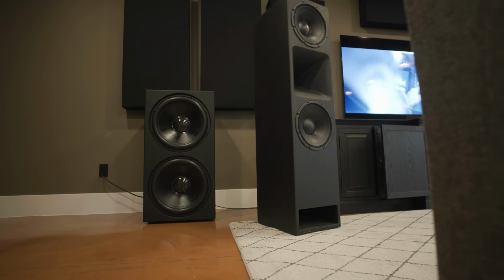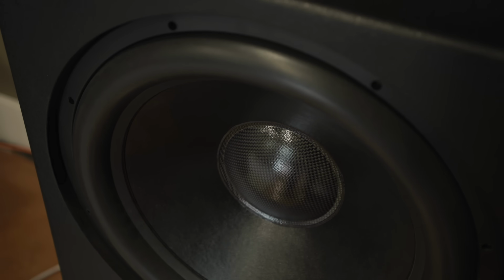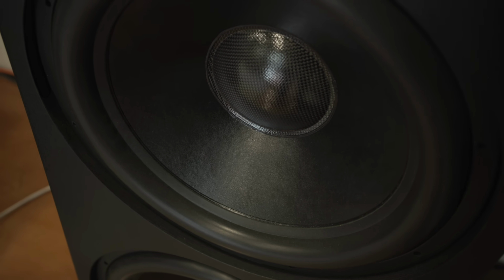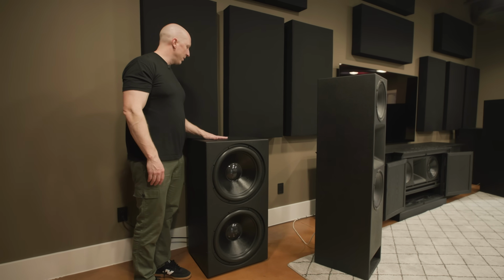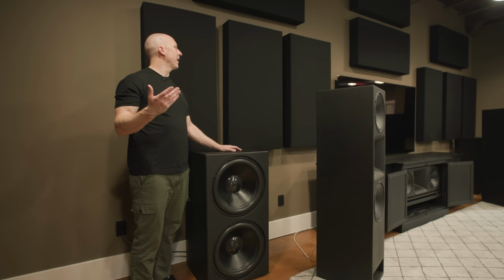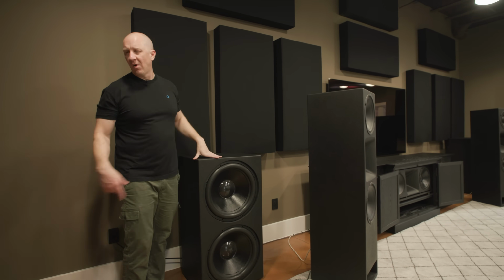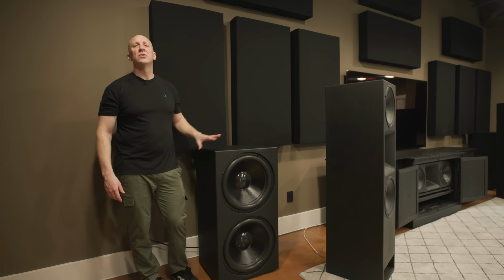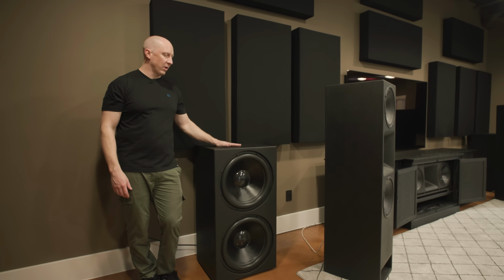And so the way that we had to structure the power in this room, in order to make sure we get good clean power but also not trip breakers, all the circuits in this house are 20 amp, and so that's helpful. But this subwoofer is on the room circuit. So we really don't have anything else in this room. Lighting has its own circuit on 20 amp, and then all the outlets in this room have another 20 amp. So this subwoofer is on the room's 20 amp circuit, and it seems to be functioning okay, seems to be working well.